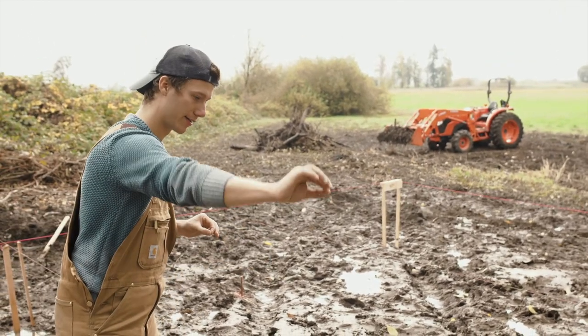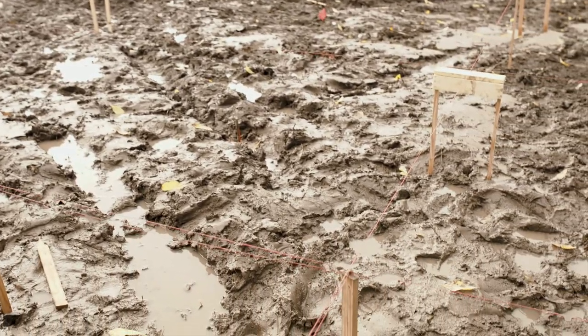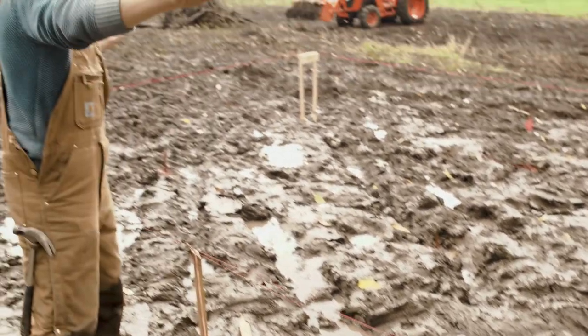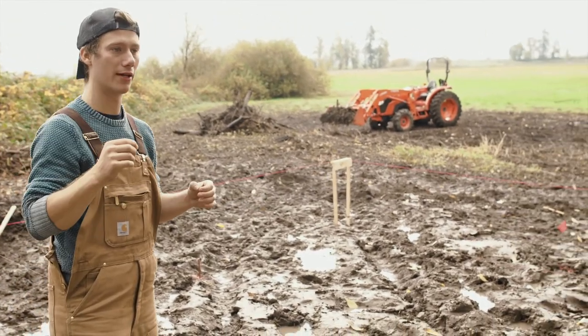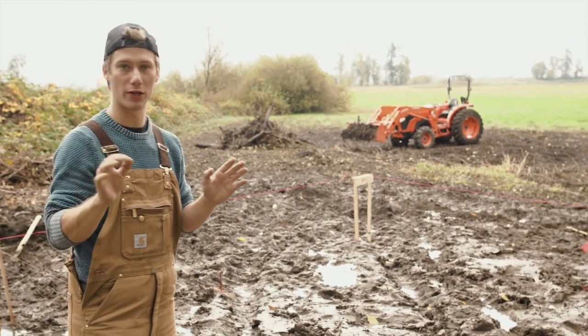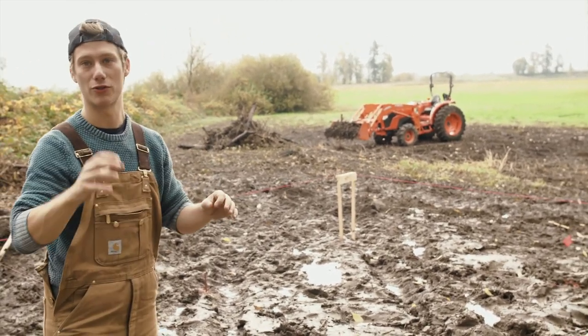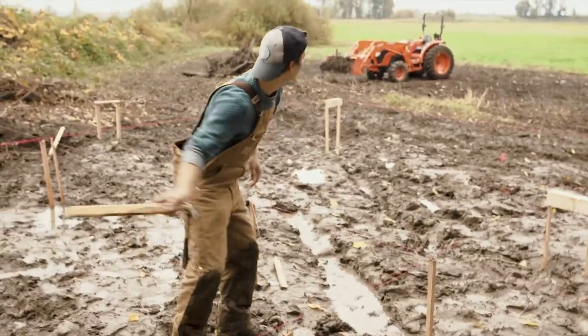You run these lines along your right angle, and you extend them past where you're gonna be building the platform. That just makes it easier when you have to remove the line because you're digging the hole. You leave the batter boards where they are, and you can put the line back once you're done digging holes, or whatever you want to do. I don't need these.